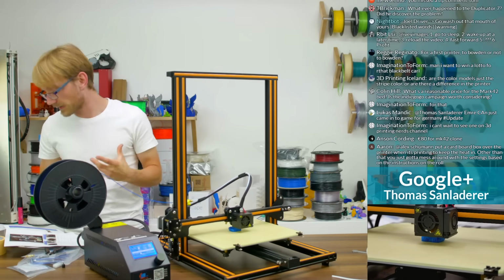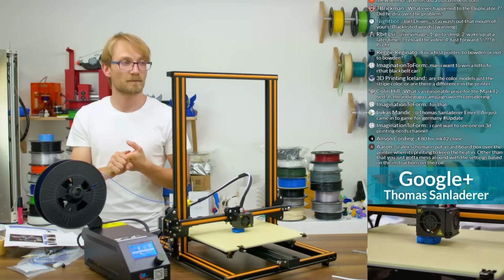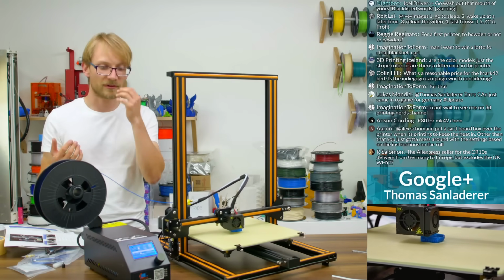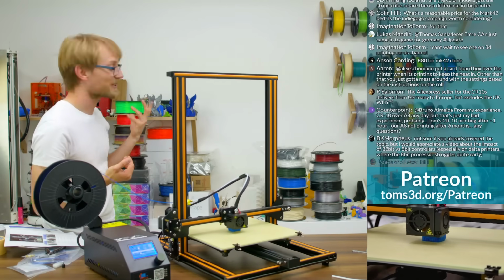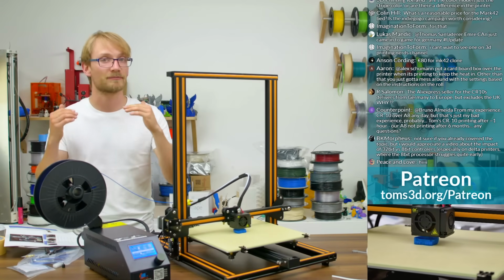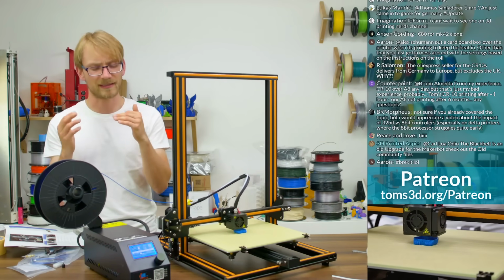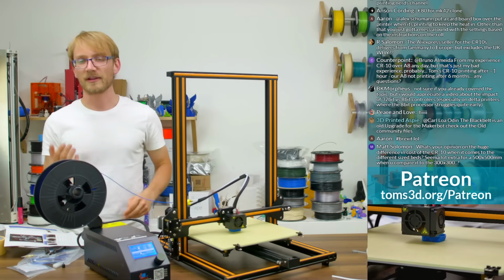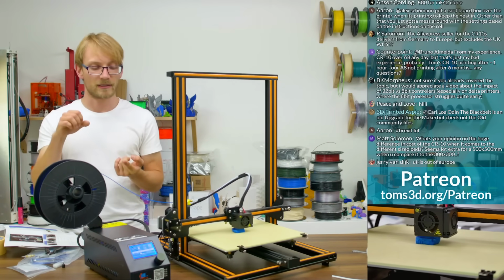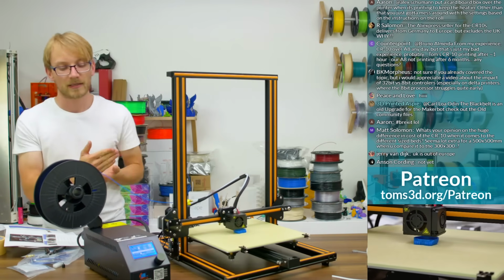So far I've not been using these super cheap eBay special $10 per spool filaments. And to be honest, I don't really pay for my filaments. Companies just send me stuff, so I get some nice stuff, but the filament I've been printing the most with is the basic consistent stuff that you get at $20 or $15 per kilogram. I find that is a good sweet spot, where you get consistent quality, the same stuff from the same vendor all the time, and you can keep using your settings. You don't have to tune in every spool from zero again. That's what I've been using.